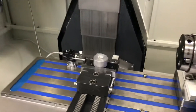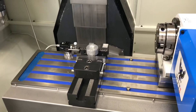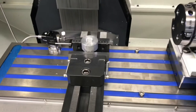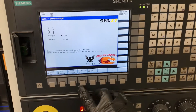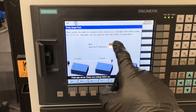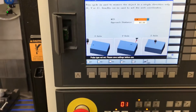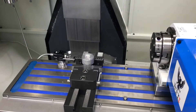The next thing I'm going to do is use the custom screens for probing this piece of round that I've got in the fixture. Now we've got the wireless probe in the spindle and we're going to set the work offset to be the center of that cylinder. So we go into custom screens, work probe, and then we're going to do a single point to start — I'll set the Z-axis first. I want to set G54 and the approach distance is 10.